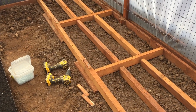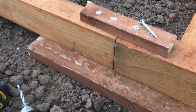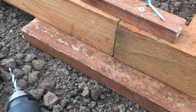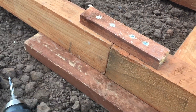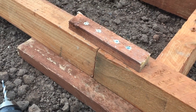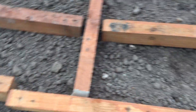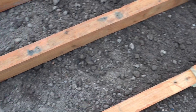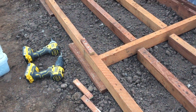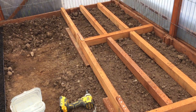I'm now securing the edge rail on the underside. I've got some old laths and at the joints I'm just screwing them in, using 40 millimetre screws, pre-drilling first because otherwise the lath will split. This will be the underside so the laths won't be visible. Once I've done all of those, I'll turn it upside down, level it all off, and make sure it all lines up before attaching it to the 800 millimetre cross rails.